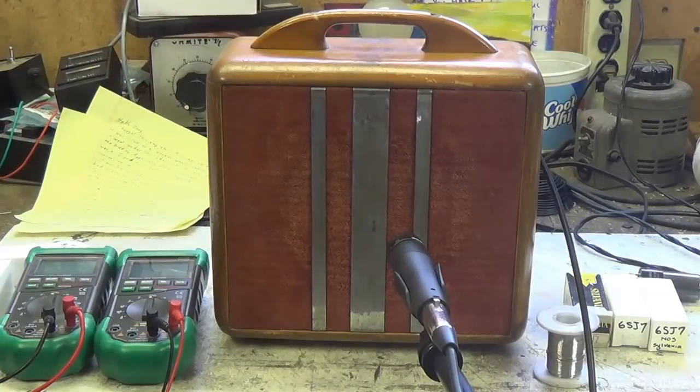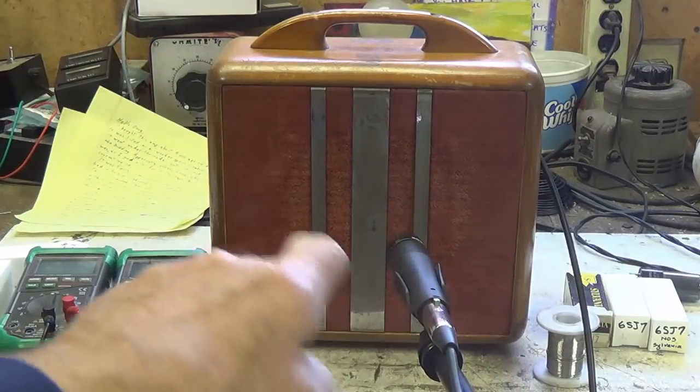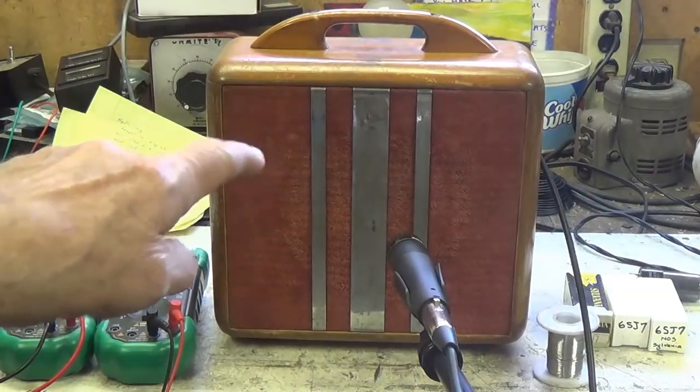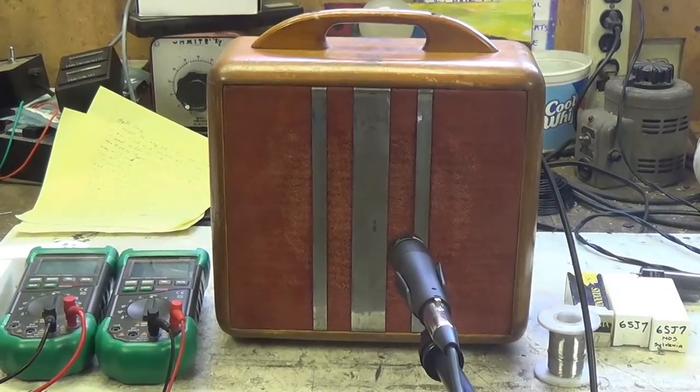Well, looks like we're ready for our audio demonstration of the mighty 1946 Princeton amp. I've got the SM57 aimed the best I can at an unobstructed portion of the speaker cone. What I'm going to do is use digitally recorded guitar music, and we're going to first hear a tune with the 6V6, then the 6K6. Then I'll do that again, 6V6, 6K6 with a second tune, and then the last four will all be with the 6V6. Okay, so if that's clear, let's get started.